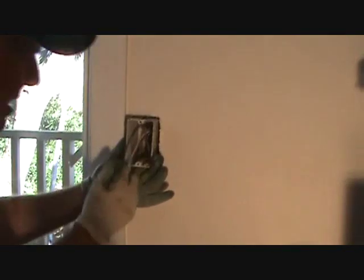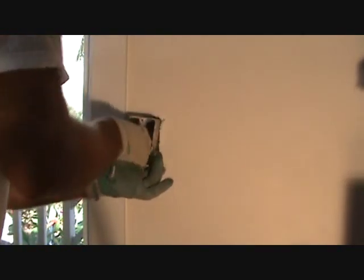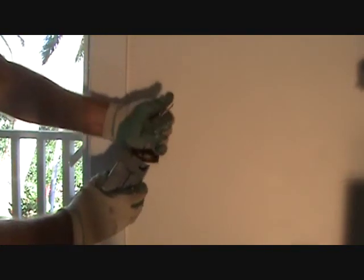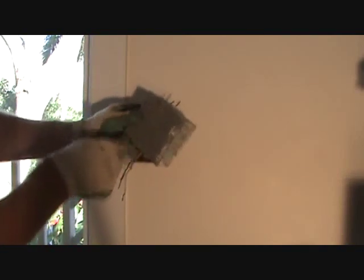Now I can just re-angle these — kind of push back on there. Take this one and push that back down. Keep pulling out of the wall a little — there it comes. Still be careful because we're trying not to damage this hole much. Pull that off — look at that. There's your box. See the two nails? See how they came over here? We just chop those ends off right up against that stud.